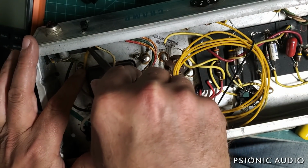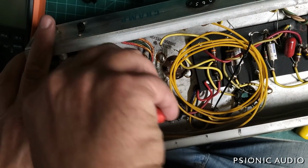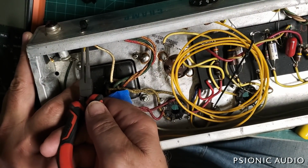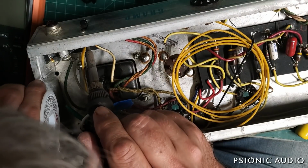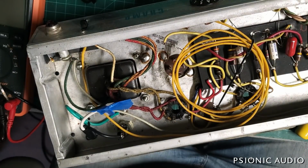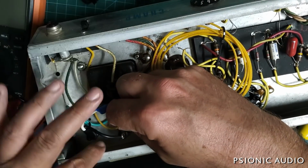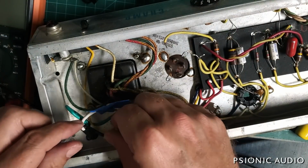And the third factor being, this is exactly what Fender used for the power wiring in all the 60s amps, including the Twins and Showmans and other stuff where there was more current than there is present on a Champ. Now granted, most of those wires are 5 inches or shorter because Fender was very aware of the same current capability issues and what all the variables are. So this will actually be what Fender would have done in 1965, 64, if they had wired a Champ up to modern electrical safety codes. And this will work absolutely fine without any issue.